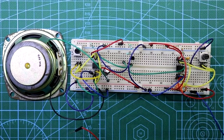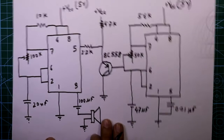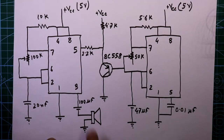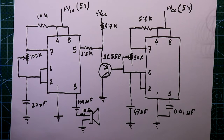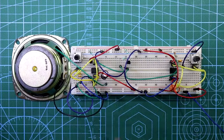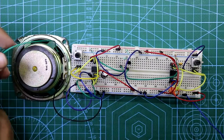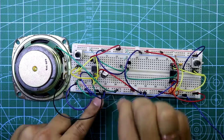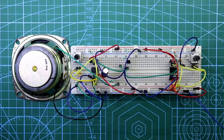The sound is not good, so before the speaker just connect one resistor with a minimum resistance value of 10 ohms — it will fix the problem. On the breadboard, remove the direct connection and connect a 10 ohm resistor in series with the capacitor, then reconnect.